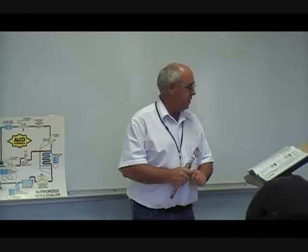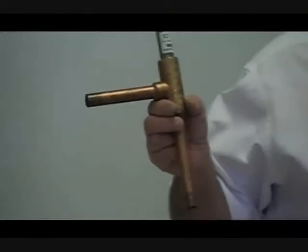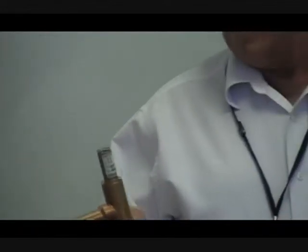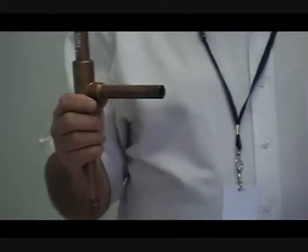Using unit 78 of Fundamentals of HVACR as a guide — one of the textbooks used here at the school — the first item is a CPR. A CPR is a device that helps keep the compressor from being overloaded during startup or a high-load condition. It limits the amount of pressure on the crankcase of the compressor. When adjusted, it has to be adjusted when the compressor is under a full load, and you adjust the outlet pressure going to the compressor for about 120% of the full load rating.